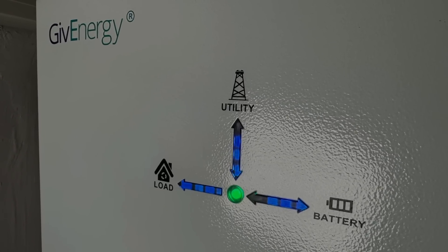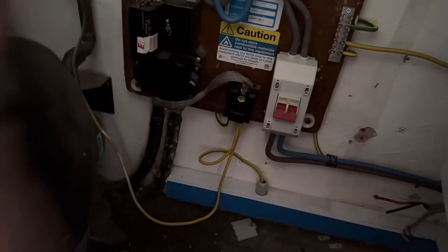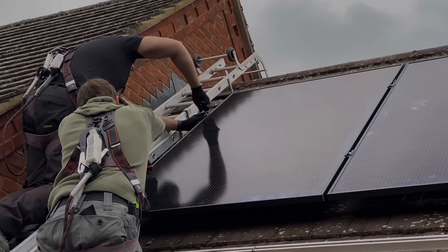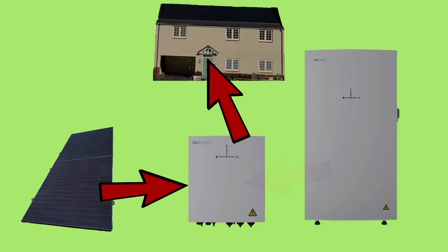So what does it really do? Well, this is where the Give Gateway is really clever. In the event of a power cut, it can switch over to backup power in under 20 milliseconds, but it can also optimise your PV generation. For example, if we have a power cut with 70% in the battery and power coming in from the PV array, the Give Gateway will automatically move the power to where it's needed — sending it to the property and throwing any surplus back into the battery. The customer won't even know they've had a power cut.